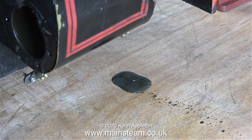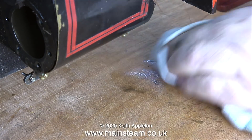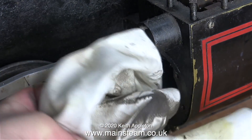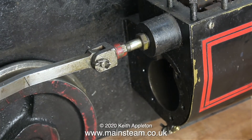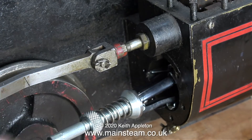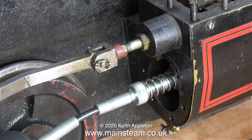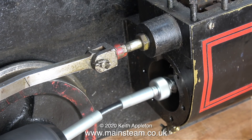This oil is very black and dirty and at the moment it's dripping out of the drain cocks. After I uploaded the last video all about getting the speedy locomotive to work, a viewer asked how come only one piston and valve was seized in the cylinder. The reason was because both of the drain cocks at that side of the engine on that particular cylinder appear to be blocked up.